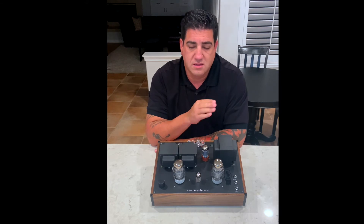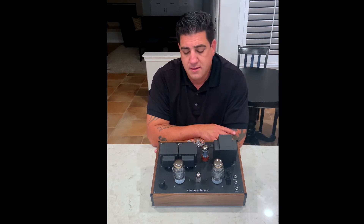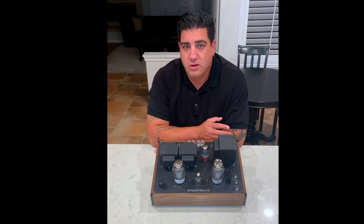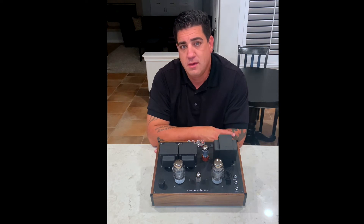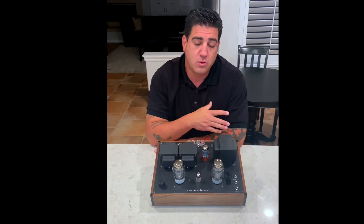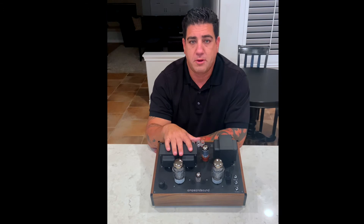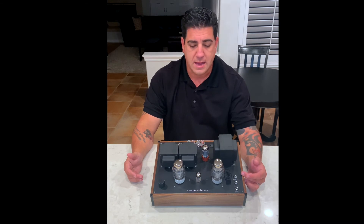The power tubes — we still allow you to run 6L6GCs through KT90s. We're not compatible with KT120s or KT150s. What's so important about this amplifier is that you can run just a matched pair of old tubes that you get on eBay inexpensively. It's a single-ended amp, no feedback, and get that true, pure sound. All of these amps are strapped for triode, so we're going for low noise floor and wide bandwidth. To that are very special proprietary transformers, giving you an 8-ohm on the low Z, 32-ohm, and 300-ohm taps, so you have a lot of choices.